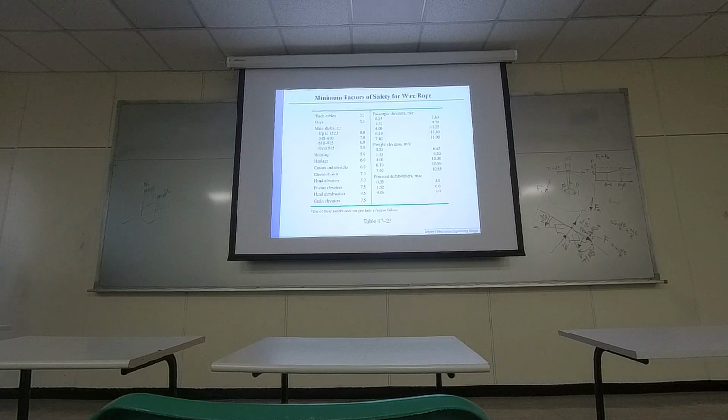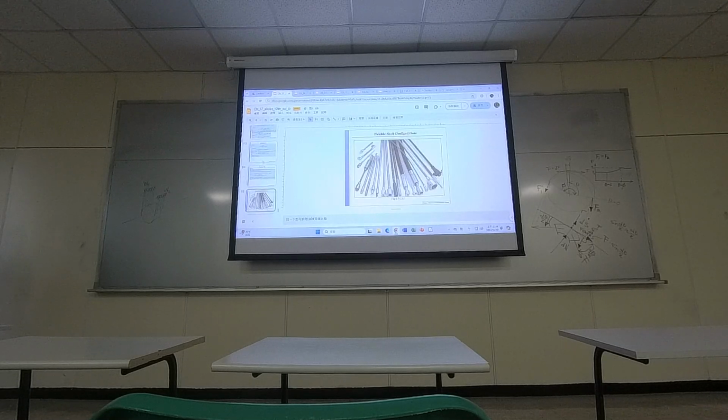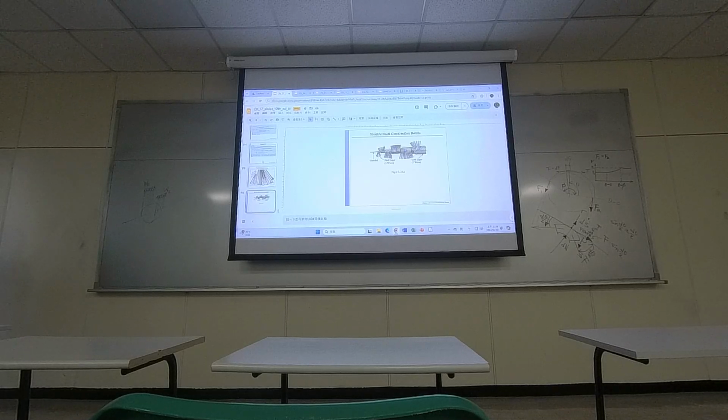Okay, anyway, I just want to let you know, for elevators, it's because you are carrying human life. That's why the safety factor applied to wire ropes usually has a recommended level of safety. And for elevator, it could be as large as 10. Okay, anyway, the textbook includes wire ropes. What else? I think that's the end. Yeah, that's the end.